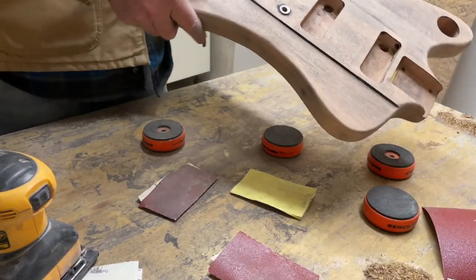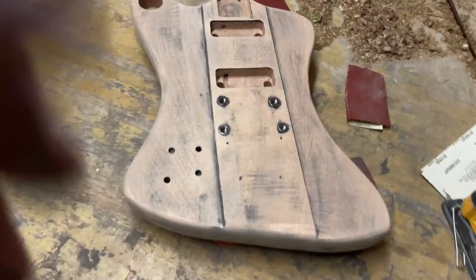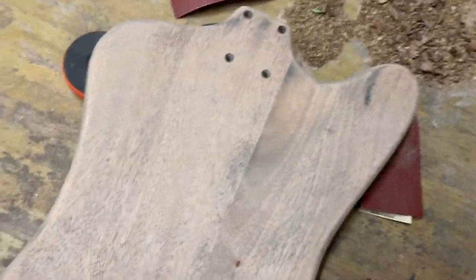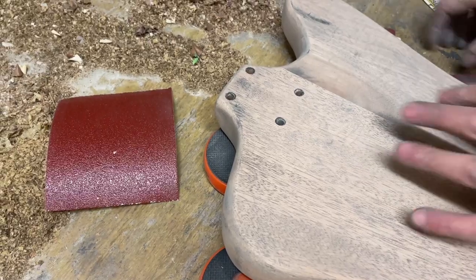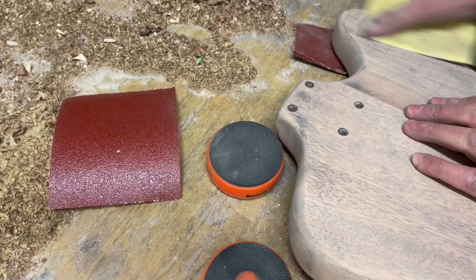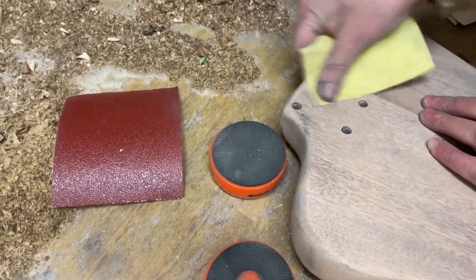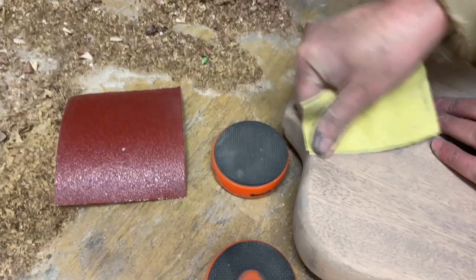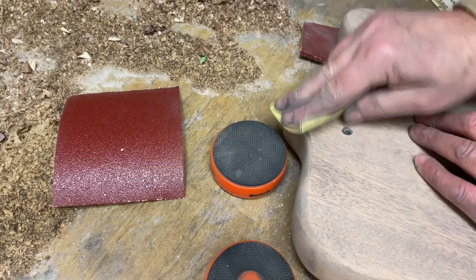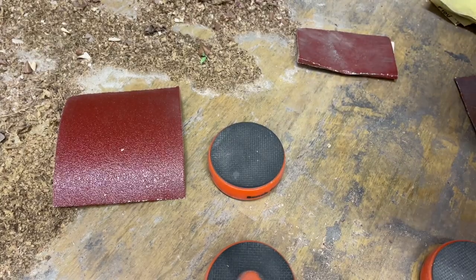So I think we're nearly there. You see that? It's deliberately a little bit mucky with some texture in it, some dark in the cracks, as you can see. And then actually fairly plain on the back because of the way the grain is. It's not terribly interesting. But we've got a couple of patches here that we maybe just lighten up a bit so they don't stand out too crazy. Round them off so that they blend, and avoid it looking like obvious deliberate painting with stain. It should look more like a natural relic than somebody who's deliberately set at it.